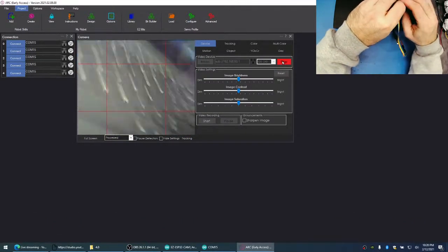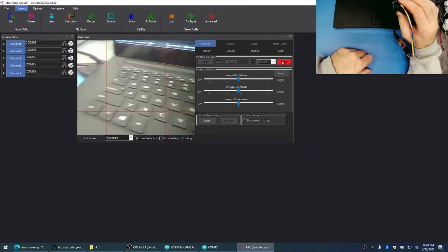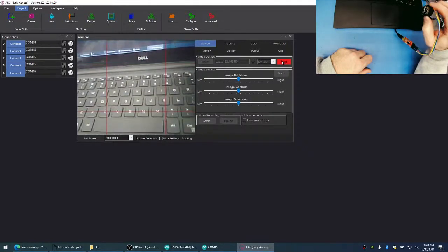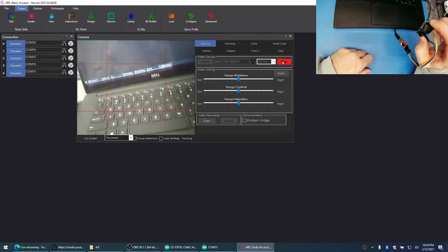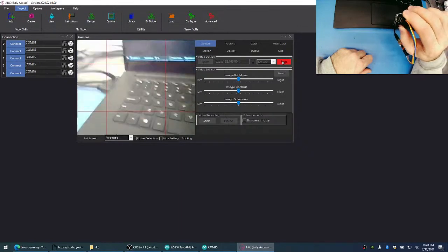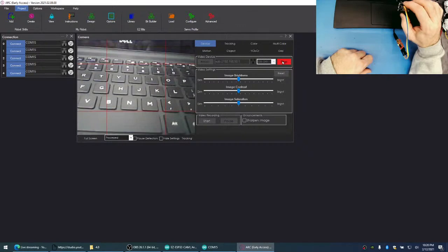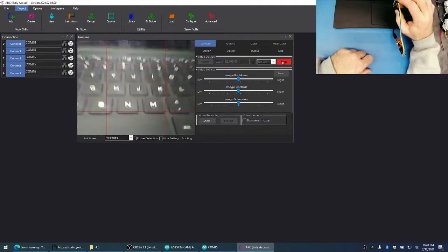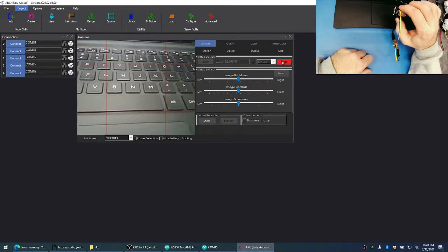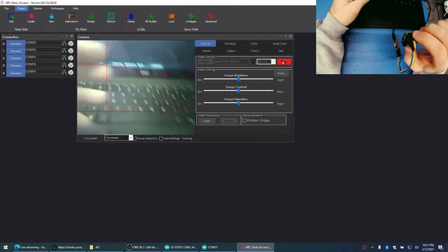Okay, there's our problem. Here's the issue, guys. I think the issue is that the clock frequency of the camera was too fast for the JPEG compressor to finish its job. Because when I lower the JPEG compressor, it means it's doing less algorithm, and we're not getting that issue anymore.